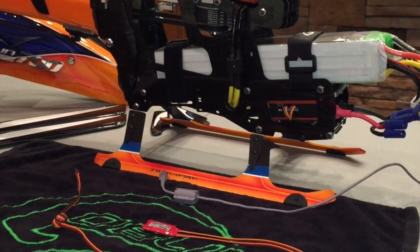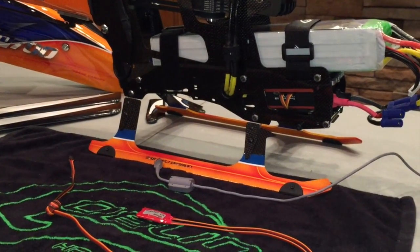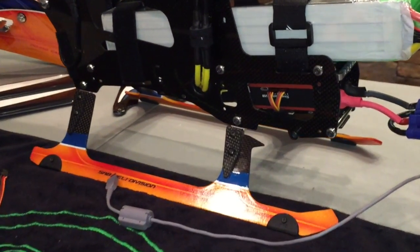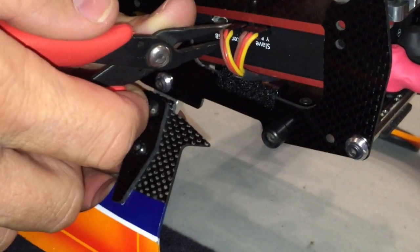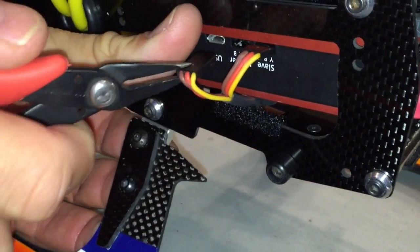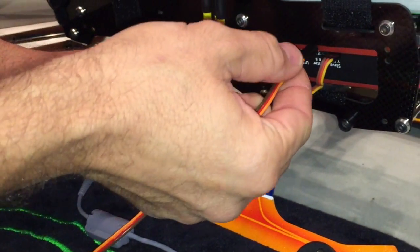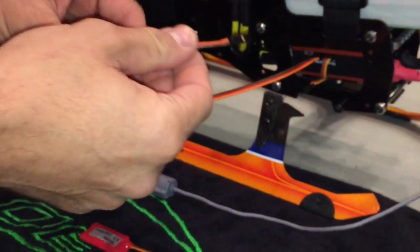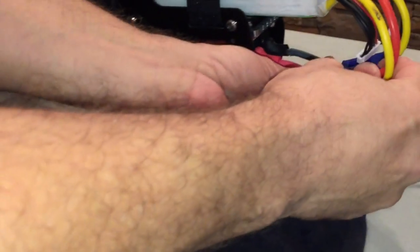Before proceeding any further, for safety reasons, we should either disconnect the motor leads, the motor pinion or pulley, or at least remove the main and tail rotor blades. Now prepare the ESC by unplugging your receiver or flybarless controller from the master port. This is where we will connect the Prog Unit in a few moments. Next, connect a double-ended male servo cable into the master port, and then power up the ESC with a charged battery pack.